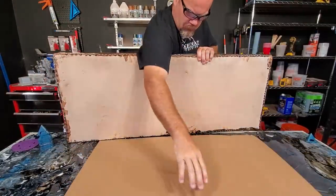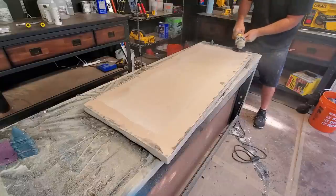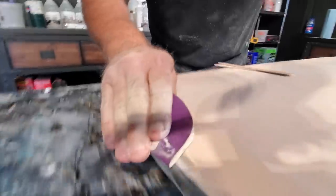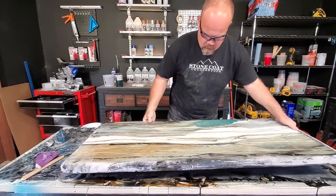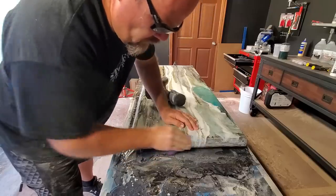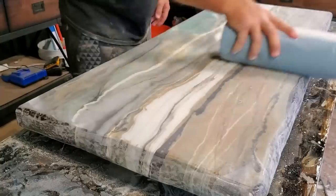I'm going to lay the top upside down on a piece of cardboard so I don't scratch it up. I'll use my 50 grit metal sanding disc to remove the drips and prep this piece to receive our ultimate top coat, which gives it a very natural non-shiny sheen level. Then I'll use 220 grit to shave off any remaining little bumps and nibs on those bottom edges, and address the sides of the edges. I'm going to sand everything with 220 grit to prep for a good mechanical bond between the clear coat and the top coat — this is a pro tip and how you get fantastic adhesion.